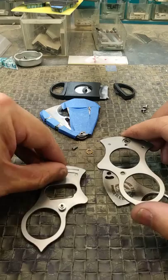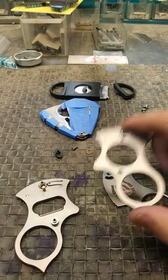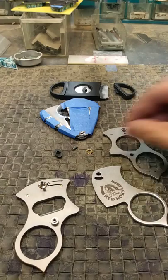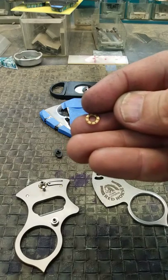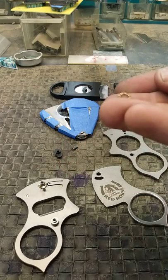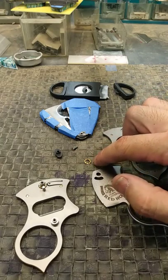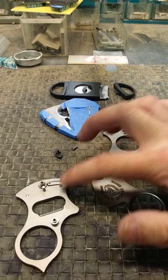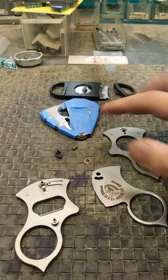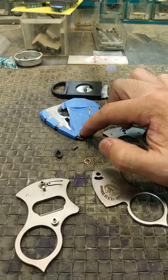The base is also shouldered — that's so these titanium body pieces line up in the exact same place every single time. It's the details that make the cutter, and the higher the details, the better it's going to function. Take these bearings, for example — they're very expensive. When I put them on my knives, they cost me about $7 for a set. These are the highest quality ceramic bearings you can get. The bearings act as buffer or lubricant points between the metal parts, so you have that smooth gliding action. The ceramic detent holds the blade in and snaps it closed tight unless you want it open. These other two cutters don't have any sort of action buffer — they are literally just metal riding on metal, which will eventually mess up your tolerances.